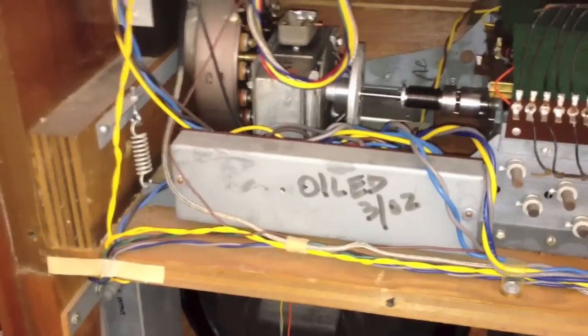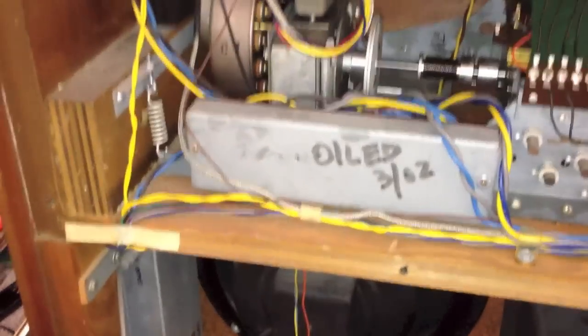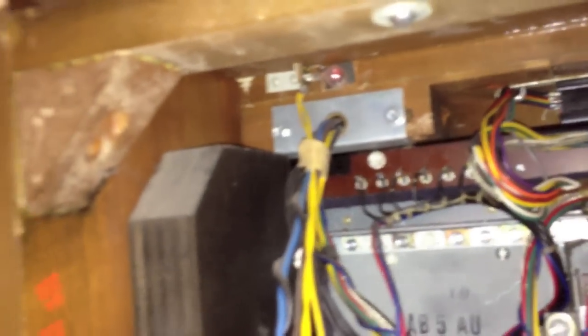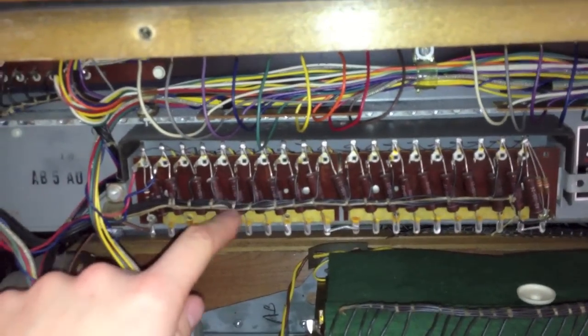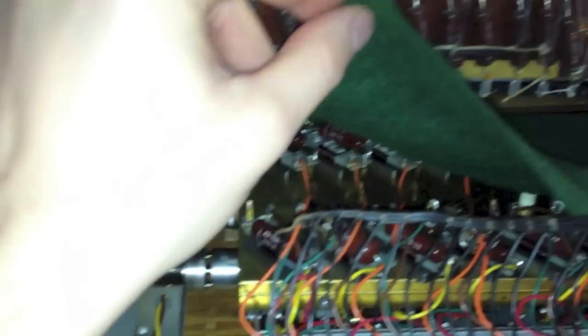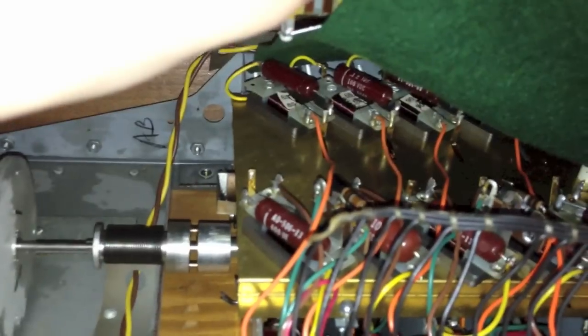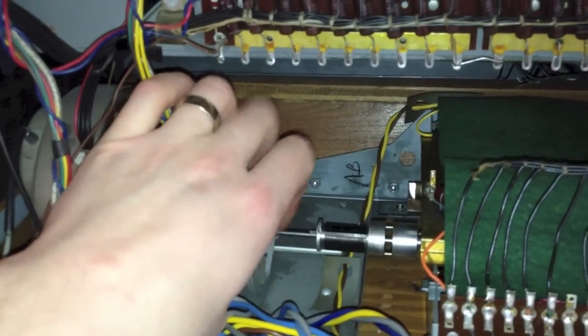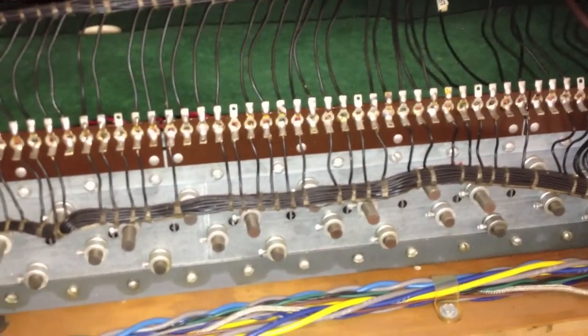All right, so there's our answer — it literally has been more than 10 years since this organ was oiled. For those of you who are not familiar with the back of a Hammond organ, this is the terminal strip where the power comes in and gets routed into the various parts of the organ. This cabling is going up to the power switch. This is the vibrato scanner, and this is the vibrato line delay right here. I'm very happy to see the famous red capacitors. This is the tone generator right here — this big box. This is where all of the individual tones are simultaneously generated inside a Hammond organ. There are 91 little wheels behind each of these magnets and they're all constantly turning. There's a big shaft that runs the length of the organ, turns all of these wheels, and that's how it gets its tones.